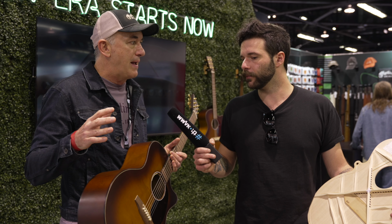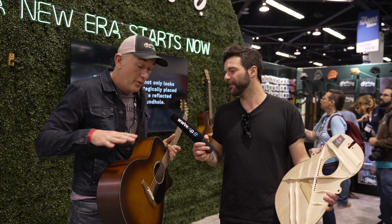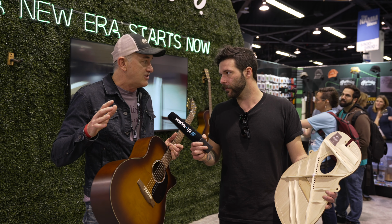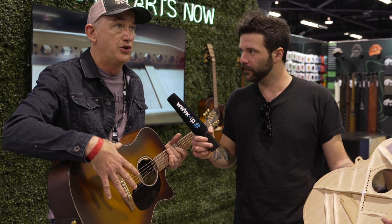Exactly. Most people try to overcome that flavor of the maple by just making bigger guitars, lots of jumbos and things like that. But we knew we wanted to make a smaller guitar, a small body with a cutaway. So using maple with a small cutaway presented certain problems. We wanted to sweeten up the sound a little bit. We needed the top to move more.